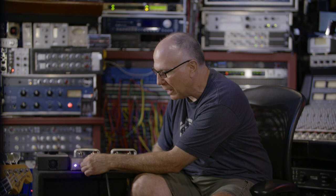This is with a passive bass. We've spent a lot of time dealing with active basses as well, which is super important. I love both and a lot of times I'll go back and forth on a track between passive and active basses. So the ability to pad this thing — if this was an active bass with a lot of output, we could pad it down, which will automatically reduce it and not blow up stuff. You've got a lot of control in the gain pot; with an active bass you might need to turn it down a little more. You could also pull V1 out and put a 12AT7 in for a little less gain, or for 70s bass disco sounds or just super flat, just a lot less gain.